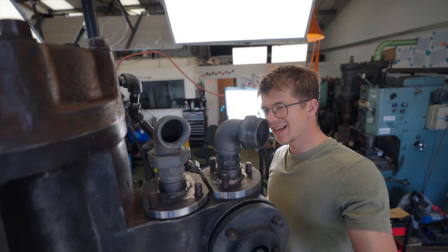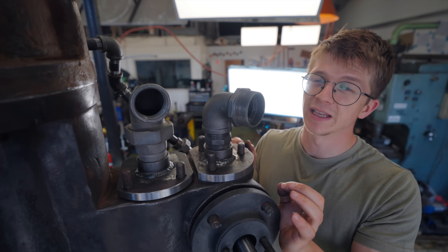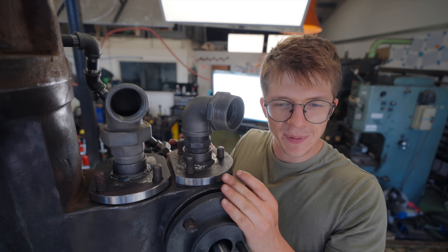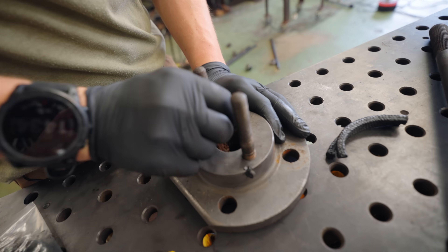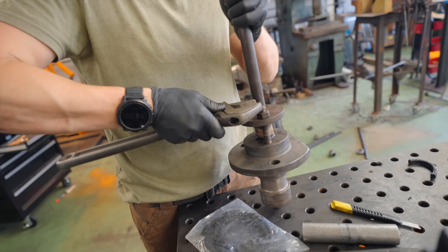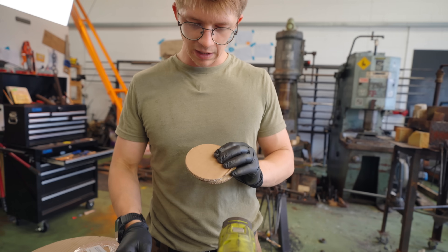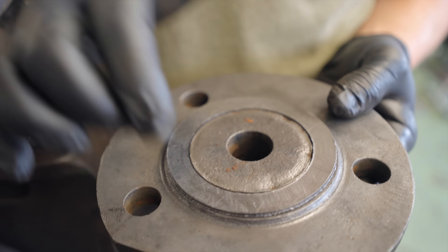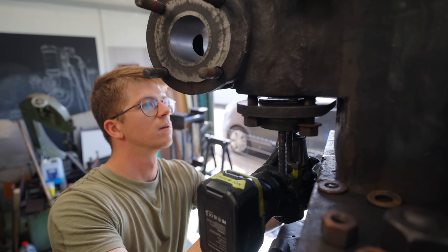On we go. This means we can now do the absolute proper and final... well, that's a lie — there's no way this can be the final assembly because I'm sure I'm going to have to take it apart. But I want to put gaskets in place, I want to put gland packing in place — this whole rear valve stuff, we're assembling it. Let's go find our gaskets. I got that thing out of there. Oh, that moves so smoothly — the wonders of graphite rope. We've got to be careful with these things, they look very fragile. It's so cute — like it was made for it with the help of a computer.